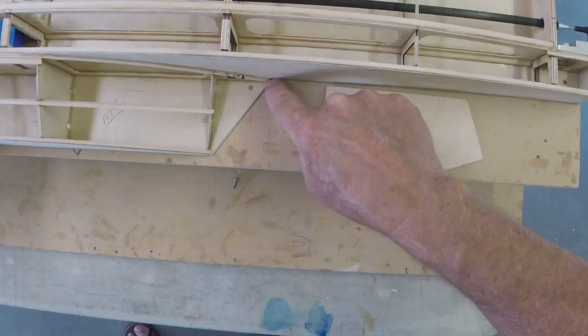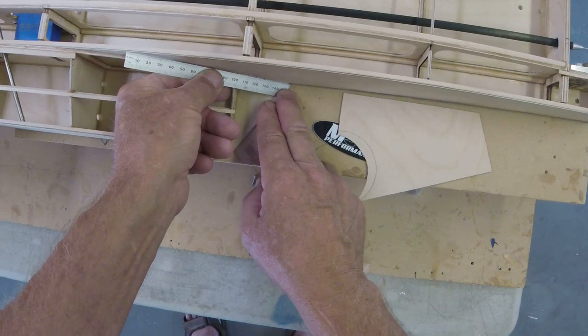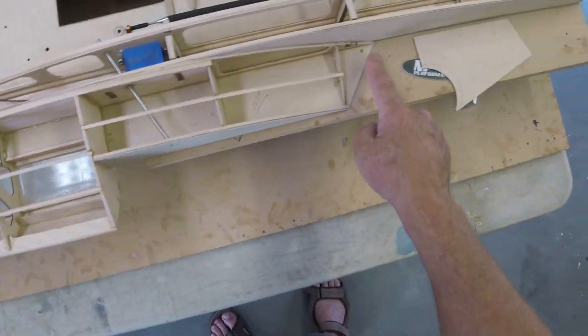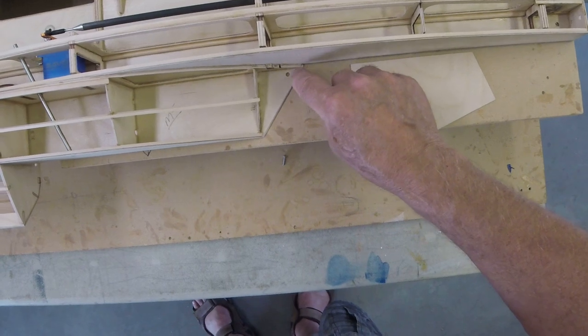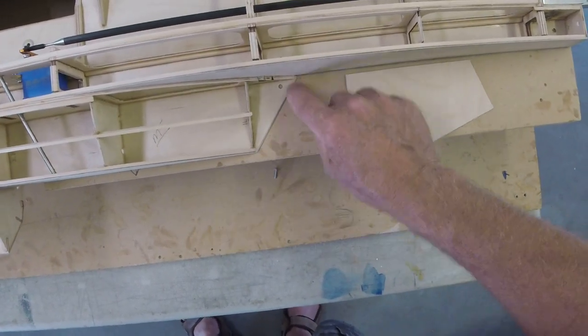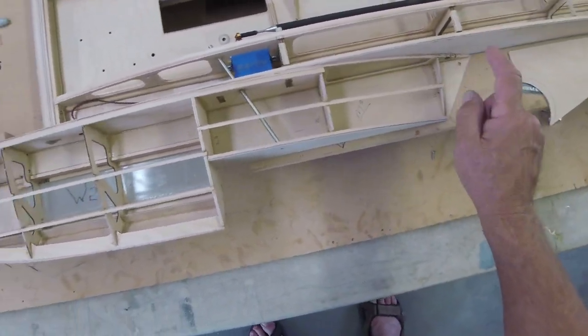Okay. You can probably tell here, you tapered sand this here to give yourself a flat landing back here as well. Again, if it's not perfect, that's okay. The epoxy will help. But when you think about it, we're clamping down here on just this thin little piece. This is all that's holding it. So try to make it fit nicely, and then when we do it, we're gonna stand a whole bunch of epoxy back here so that it holds really, really well.